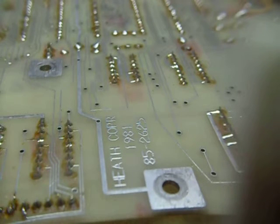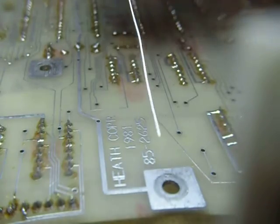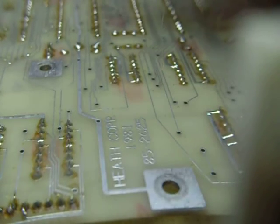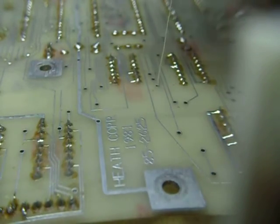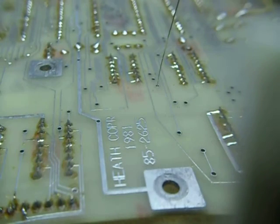What do I do? Well, they're quite easy to fix really. The first thing you do is you want some very very fine wire. I've got some wire wrap wire here and I'm going to strip just a little bit of it. This is the wire wrap wire I'm using — it's like a number 28 wire — and as you can see it goes easily down into those holes.